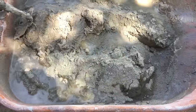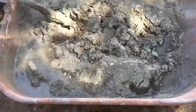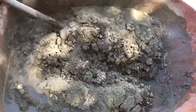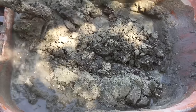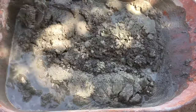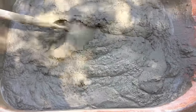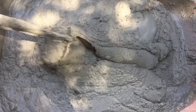Once you've done that, give it a final mix. Make sure there aren't any white dry clumps anywhere — chop it up and really mix it well. You want a slightly more runny consistency than normal concrete because you are doing a skim coat. The Portland has been all mixed in and you can see the consistency here — it's a very loose mix and we are ready to pour it on the slab.